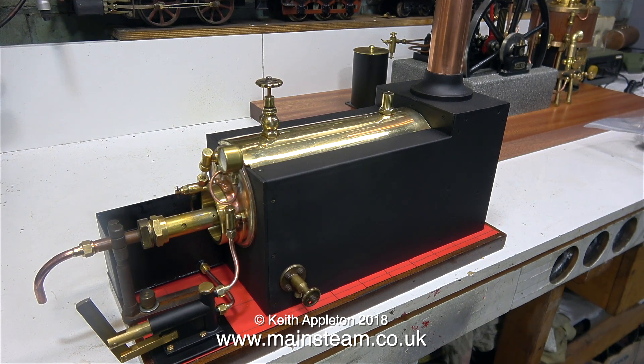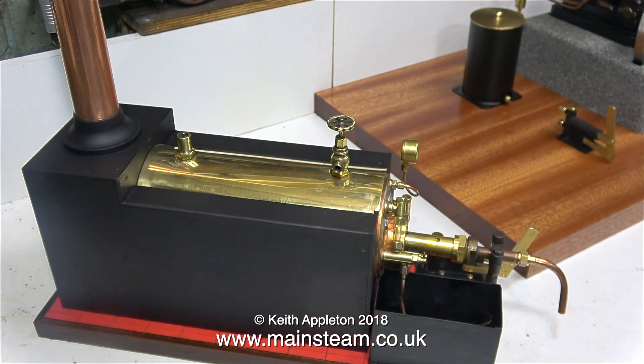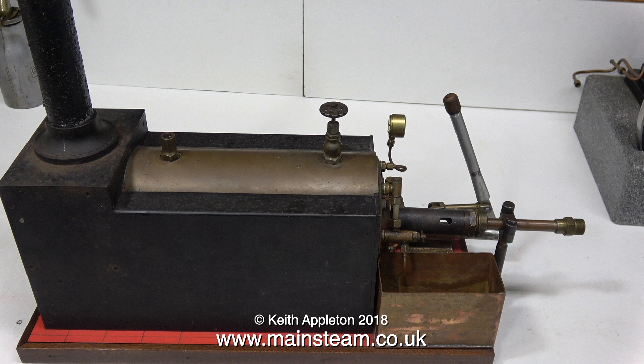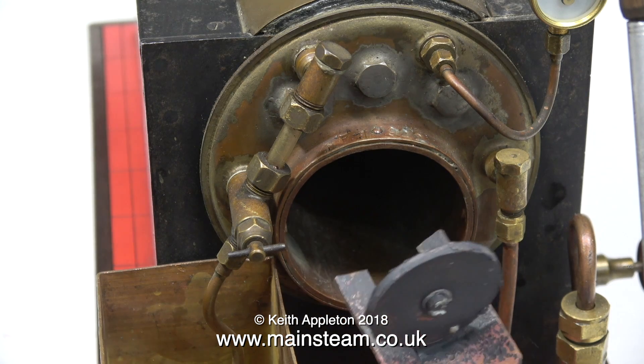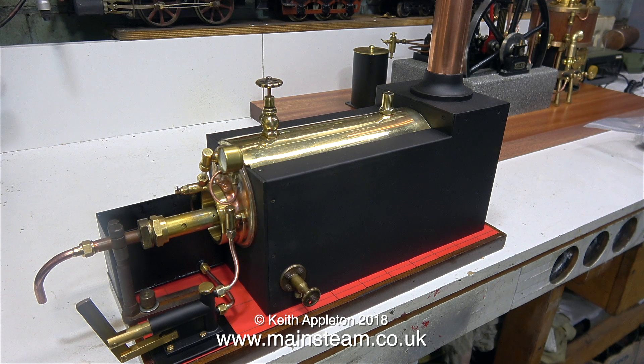So here it is, the finished job. It's a big improvement on the way it was when I first bought it, and now it's completely asbestos-free. I refitted the pipe to the water gauge blowdown valve, and that's the job really completed. And here is an A-B comparison: before, complete with the horrendous chimney and the asbestos inside it, and a ferocious gas burner that tripped my carbon monoxide alarm. This is the baffle that was inside the flue tube and really caused the flame to blow back badly. And here it is now, with a much more sensible burner. The flue tube baffle's been removed, and it's altogether a lot better. And in case you're wondering, I quite like the vintage appearance of the mounting that holds the burner, so I left it as it was. That's it, and the job is complete. Thanks for watching this series, and I hope you found it useful.